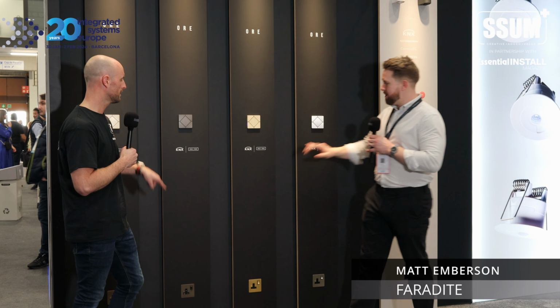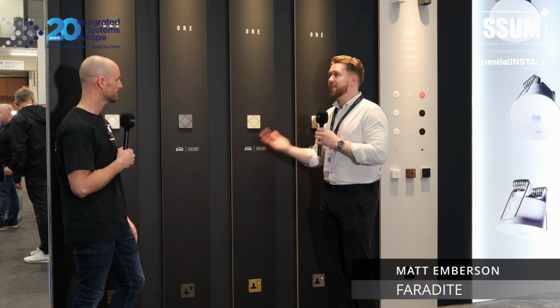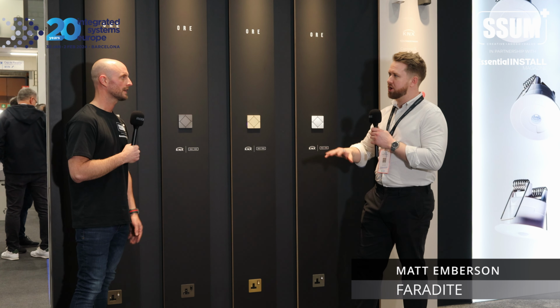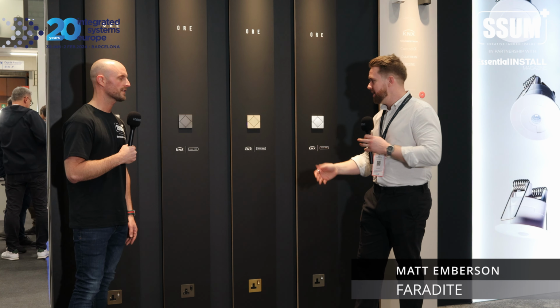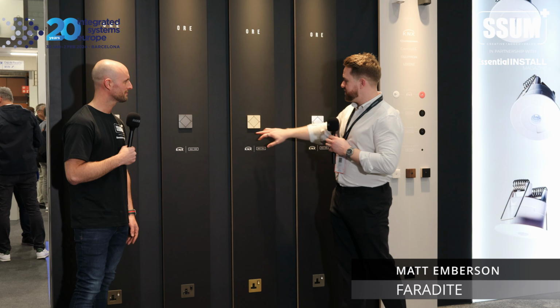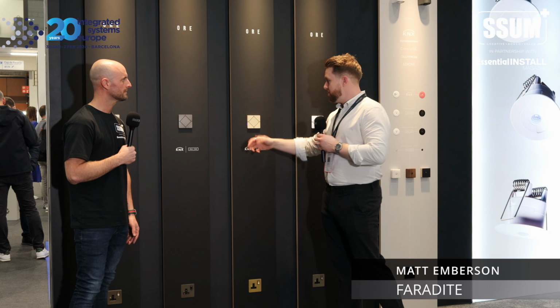Yeah, so one of the big things we've done with the KNX version, there's lots of KNX switches out there which can do anything, right? There's lots of products which claim to do everything, but that's not necessarily a good thing, because as a dealer or as an integrator, you don't want to go to a client and offer complicated everything, because the customer gets confused and you don't know what you're delivering. So what we've put on the KNX version is what we're calling Smart Scene Plate. The idea being, you walk into the room, the switch is off, the halo light is off. The middle button there will turn the lights on in the room to the first scene.